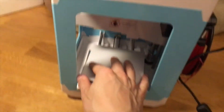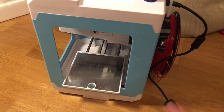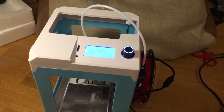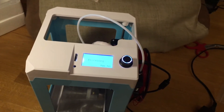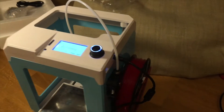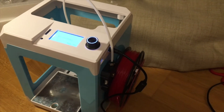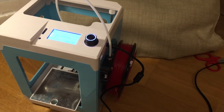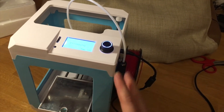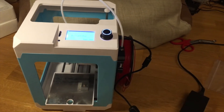Make sure there's a warning — don't touch any of the top part because that's where the nozzle is, and that's where it melts the plastic to create the model. I'm going to show you how to get models from the internet and put them onto the SD card to feed into the printer, or you could feed it directly with a USB cable. Because it takes about four to eight hours to print a model, it's better to record it onto an SD card and let it handle it. Otherwise you'd have to leave the computer on the whole time.